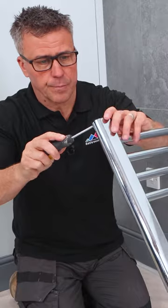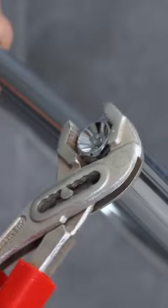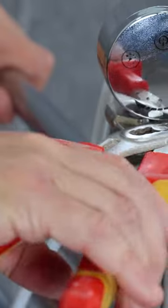I'm going to show you how to install this electric towel rail. Start with a screwdriver to remove the four plastic bungs from each corner. Apply some PTFE tape on the thread around the blanking plugs and then slowly tighten these up by hand.